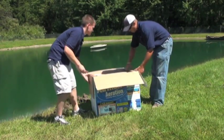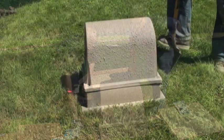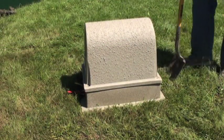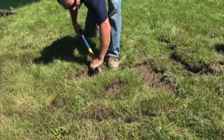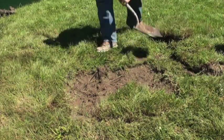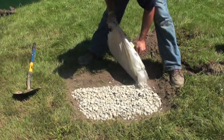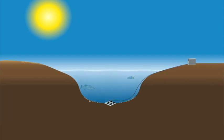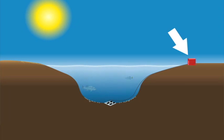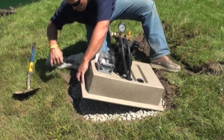You are now ready to place your cabinet. Simply place the cabinet on the ground where you've chosen to install it, trace an area about six inches wider than the cabinet on all four sides, and with a shovel or marking paint, remove the sod or loose dirt. Fill in with fine stone or gravel, giving the cabinet a solid base and allowing for proper drainage. Remember to always place your cabinet several feet higher than the highest water line of your pond to avoid flooding in the spring or during heavy rains.